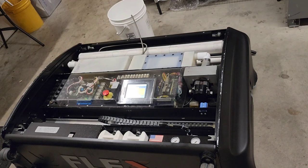I'm not going to do buffer motor brushes or drive brushes this year because they were done last year. But I do have some. They don't come in the tune-up kit anymore. That's okay. If you're planning on doing motor brushes, you're going to have to order extra brushes above and beyond your tune-up kit. And it was explained to me that because there are a few different brands of motors on the market right now, you don't need to change them out every single year, but you do want to open the caps up and blow out the carbon buildup inside of the motor so that your motors operate correctly.